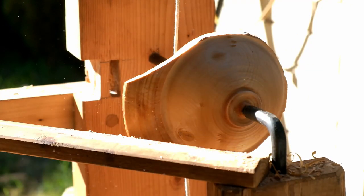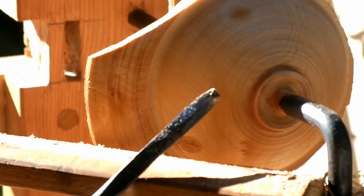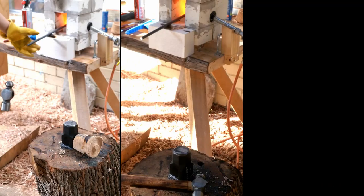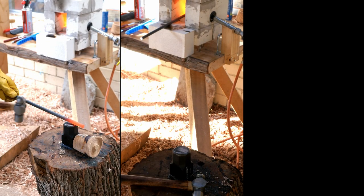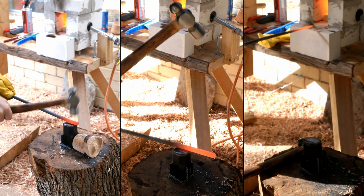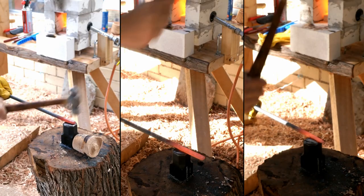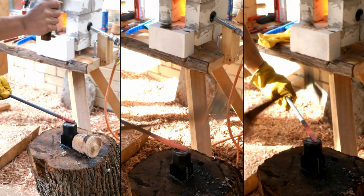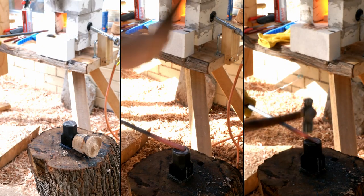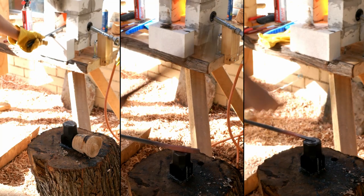You're about to get a look at the shape of the hook as I forged it. It's made from 12 millimeter spring steel round bar. You can see my setup here — I've got a small gas refractory brick forge and instead of spending money for a real anvil I've just mounted a sledgehammer into a block. The biggest limitation here is that because of the size of my improvised anvil I'm not able to use a larger hammer to move the metal more quickly and efficiently.